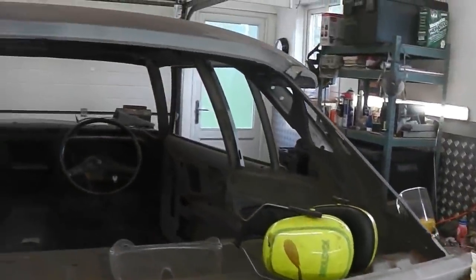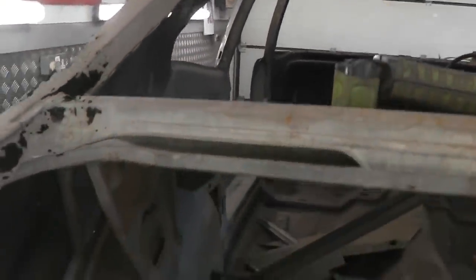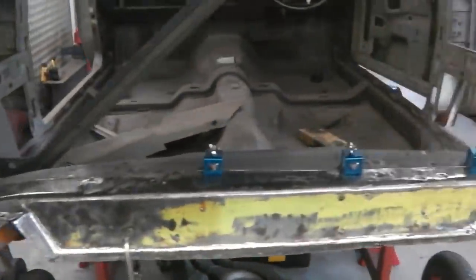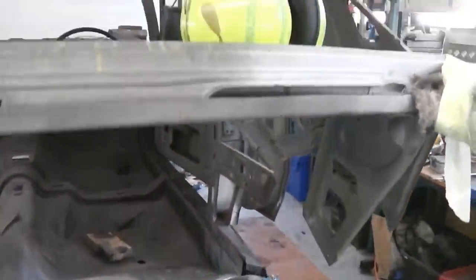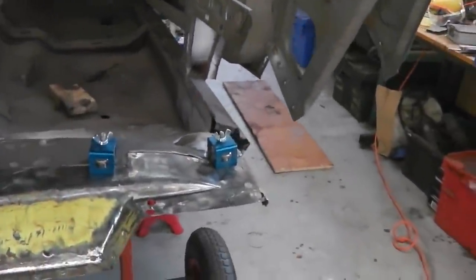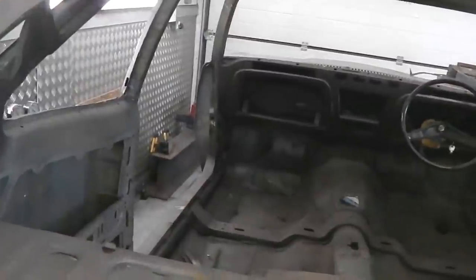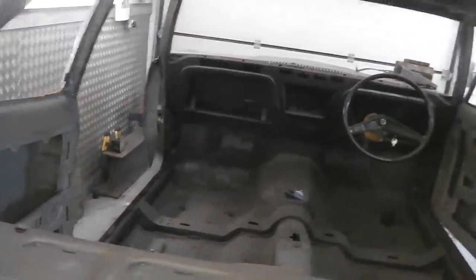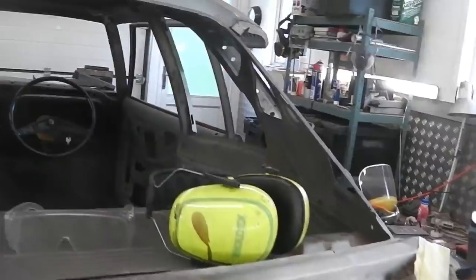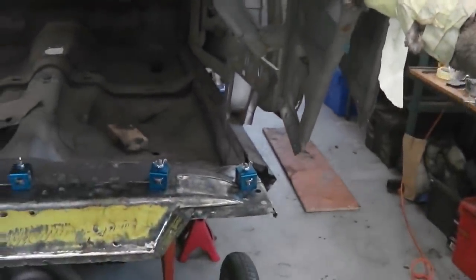We often discuss these shapes, and the square shape going round with a camera to sort of show you the points of the square on this part of the shell. So where the roof joins the back end of the floor pan, that's the corner of your square. So here we've got the wheel tub creating that and into the roof and along and then back into the other point, which is the lower footwell. So that's what creates the actual strength in the shell. Once you lock those four corners together, then you're in.